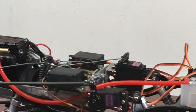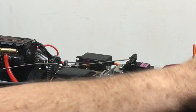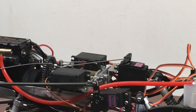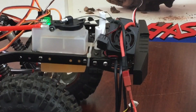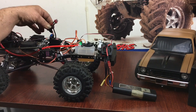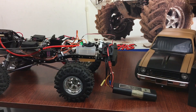I'll show you how the shifting thing works — let me plug this in for power. I like using speed controllers to run the starter motors because it's pretty convenient. You have your power coming right into your receiver that way, so you don't have to carry another battery. Basically splice the speed controller into your glow plugs and when you turn it on everything works all at once.